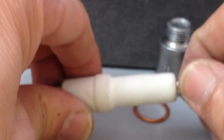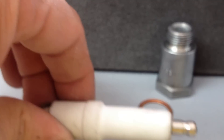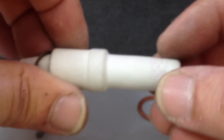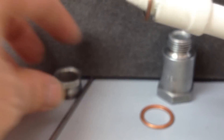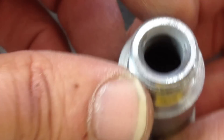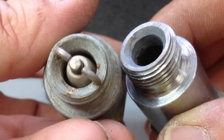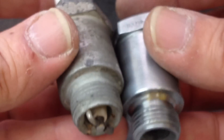It will also make it easier to retrieve the electrode in the future if I want to change it. Because if it's got investment all the way down there it's going to be pretty hard to remove. If it's just got a little bit at the top and the bottom it's quite easy just to give it a twist and it will come out — once you break the seal of the investment it will come out. With this I've just wire brushed it and cut the lugs off it. There's the other one. It just makes it easier to work with, it looks newer and so on.